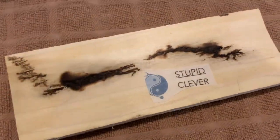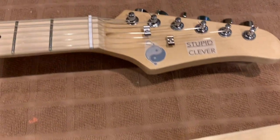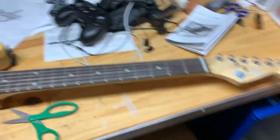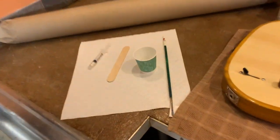I've got a test piece of wood with a chopped up logo with rice paper just to see how the epoxy looks on it, and I've got set up a headstock of one of my logos on my Acoustasonic guitar, and then a second headstock set up over here on my resonator with how I've laid out the logos to go. That's because once I mix up my tiny little bit of epoxy, I should have plenty to do all three.